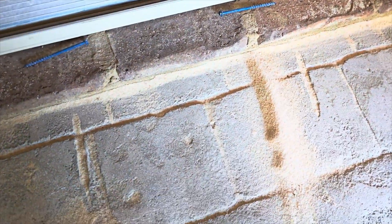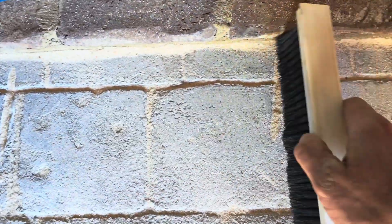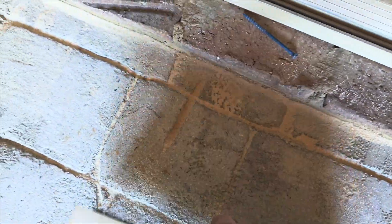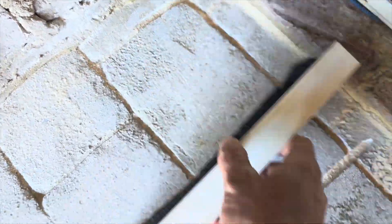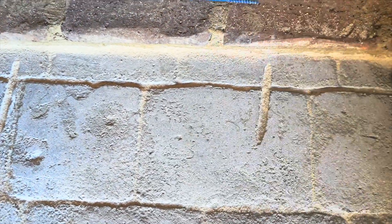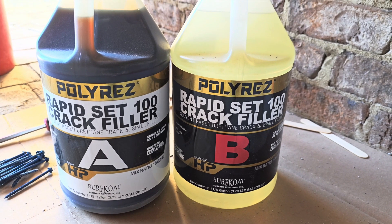The rest of it's pretty cut and dry - just brushing down through there and making sure you brush your cross cuts out enough to get your Tapcon or screw or whatever you decide to use in there. My opinion - I like to use something with some texture on it where it can't really slip. Like a nail, for example - a nail has a head on one end and the other end is smooth, so there's really nothing on the other end to keep it from moving. Anyway, I'm just going to brush this down through here.